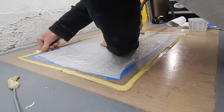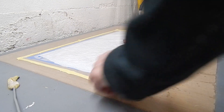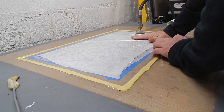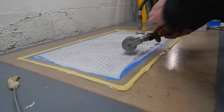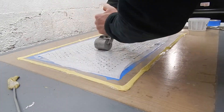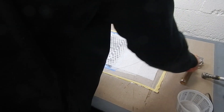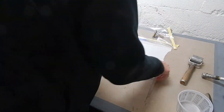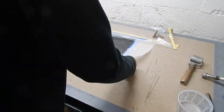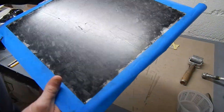I went over the tape and made sure I had enough vacuum — probably about 15 inches of mercury, about half of a full vacuum. Could have used more, but I got some bleed through the perf. I came back with a roller to try to even out the lumps. The next day, it was all cured. I came back, removed all of the material, peeled it up, and had a look.